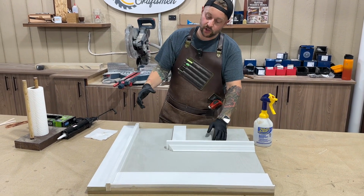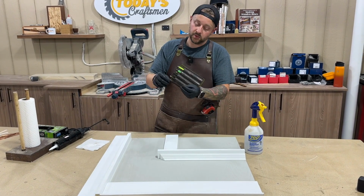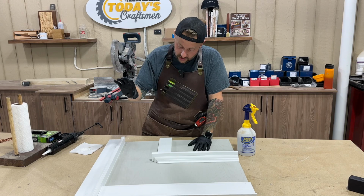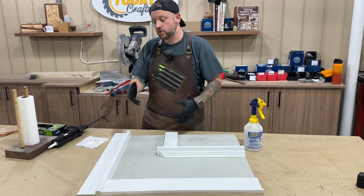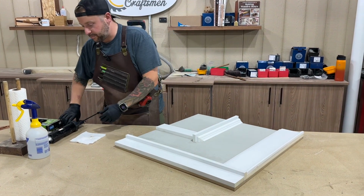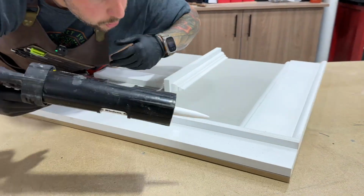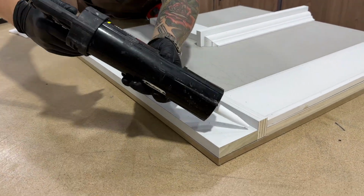This big stretch, it stretches so much that you don't need as much caulking because it'll stretch. You don't need to really cover it up with this huge bead of caulk. Really nice. So we'll just caulk a couple more here, and you can pick up on the technique. So we have this back band here. Come in. You want to make sure that where you're caulking is clean so you don't have any dust in there.